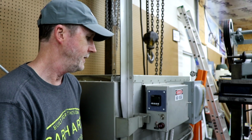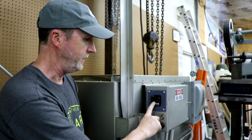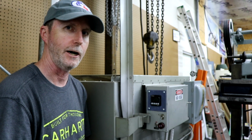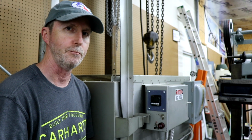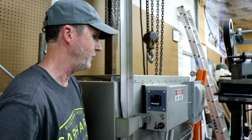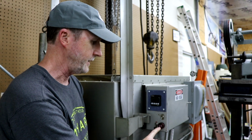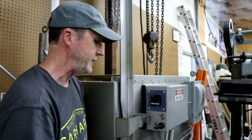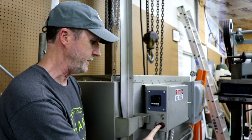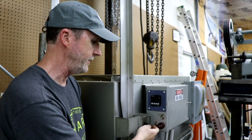My name's Gary, and today I want to look at a little feature that I'm planning to add onto my heat treat oven. I've retrofitted this old heat treat furnace with the new Novus N480D controller that you'll find on the Hotshot 360s from Barzy Industrial. Stan helped me retrofit this back when I rewired it. I've got the alarm piece here with the LED and the buzzer in it, which Stan at Barzy recommended, so I've got that wired in.